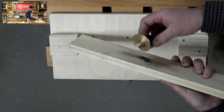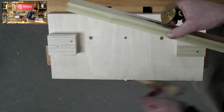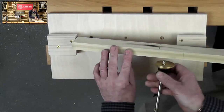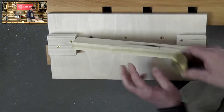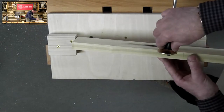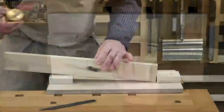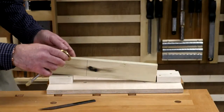I've got my cutting gauge. So this has got a sharpened wheel. I've already set it up. So this is halfway. So I can turn it round. It will be central. Now, if I'm checking for central, I can push it in with my wheel. And I did do this earlier, to save a little bit of time. Get it central, position it.